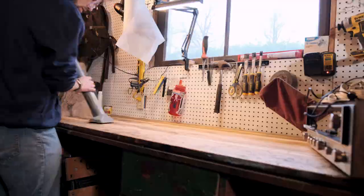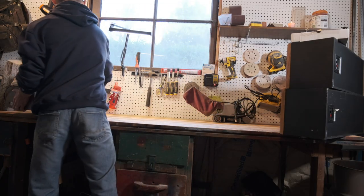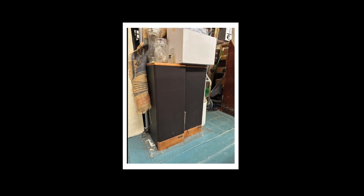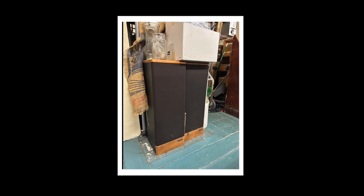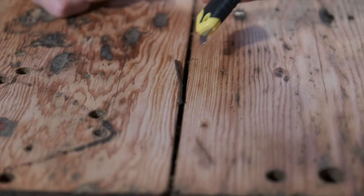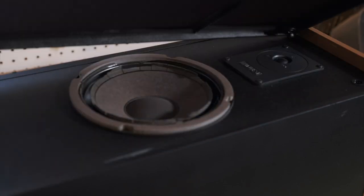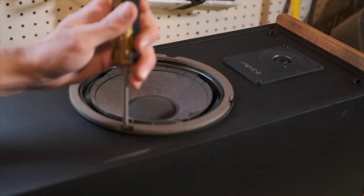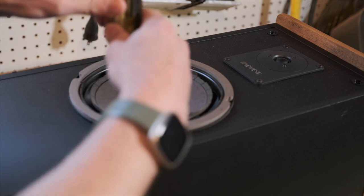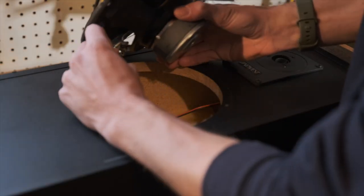For Sergi's setup, I found this receiver with no functioning lights and some sound issues, then a pair of speakers sitting forgotten in a corner at a local antique mall. The speakers worked great laying flat on their backs, but if you stood them upright they distorted because the foam surround that supports the cone had rotted away, causing the cone to sag and rub on the magnet as it moves in and out, making noise.